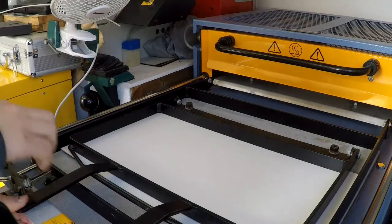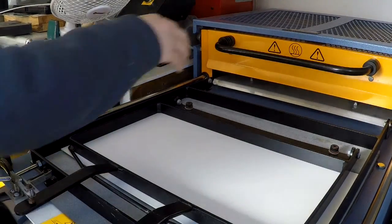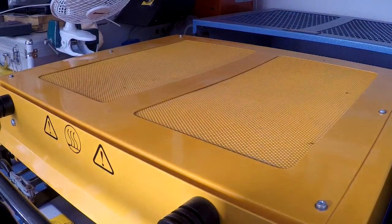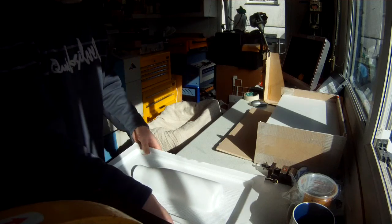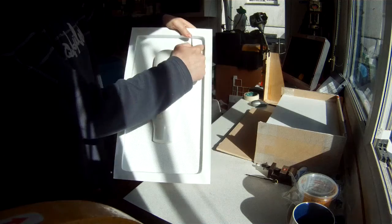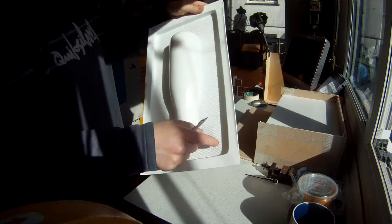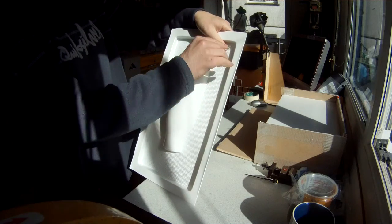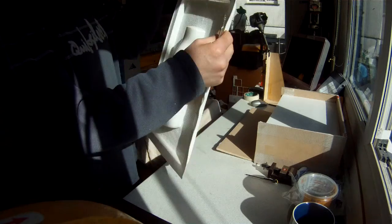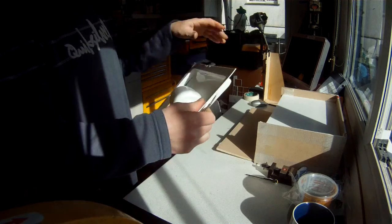Squeeze the plastic together in the frame. Pull the heater back over. While this is heating, I remove the frame. Now at the side of a vac form, it's such an extreme angle and no plastic to draw that it gets very thin, and it becomes quite easy to cut, which is good because you can just use a scalpel and cut it out the frame.